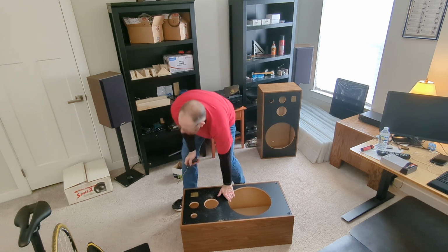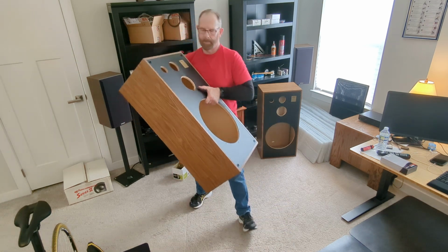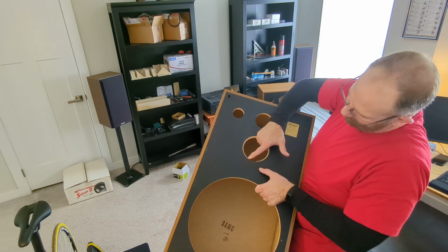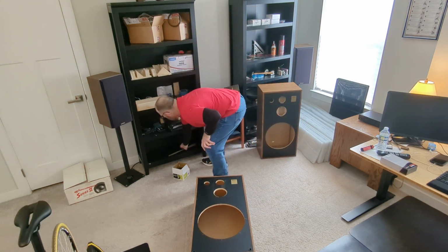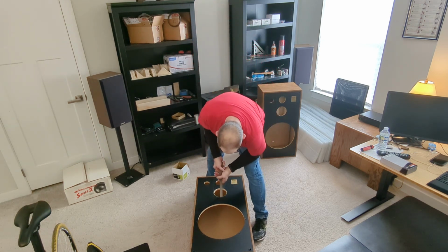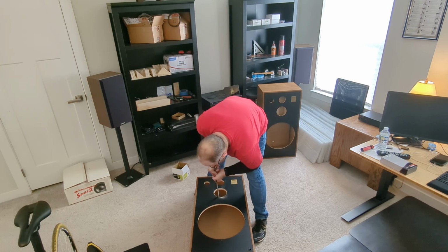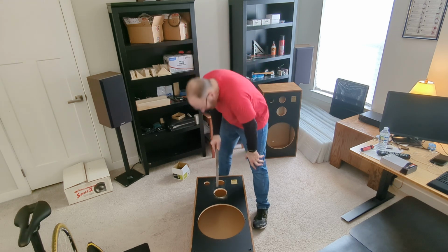Alright, so we're going to take a look at how I did. So this is what the notch looks like, just kind of raw fashion, knocking it out. And next trick, going to be cleaning that up, make it look semi-professional by filing it. This is your chance to even it up if you didn't hit it perfect.